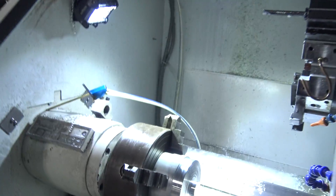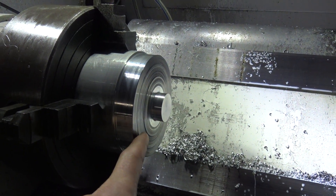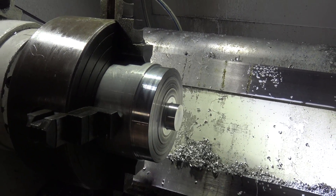The good news is I think we can fix it. I'm just going to re-zero off of this and then push everything down about a thou. I suspect that this is too shallow, so hopefully that'll clean this up and we'll be okay.